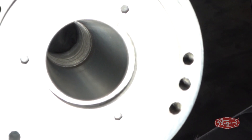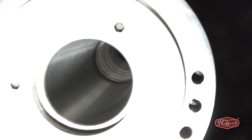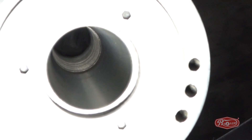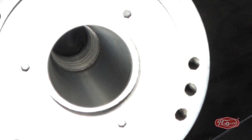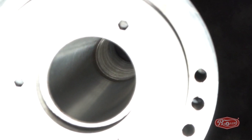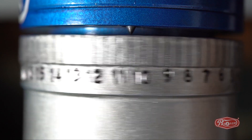A point to be kept in mind is that even a scratch in the MT5 taper can lead to a difference in accuracy. We can use either a reduction sleeve or ER40 MT5 Collet holder to achieve the desired level of accuracy for the drill bit with diameter less than 42 mm. After aligning with the hammer, we will set the spindle wheel to number 3.